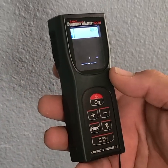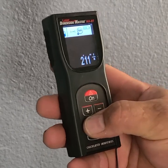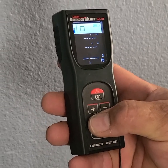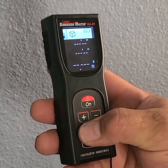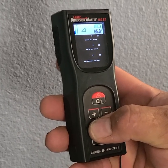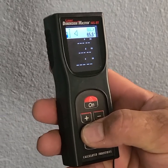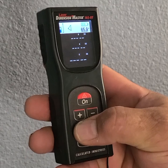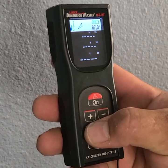On your display, an arrow indicates you're in the linear measurement mode. A square shows you're in the area measurement mode. A cube shows the volume mode. A right triangle indicates the basic indirect height mode. The isosceles triangle is the symbol for the advanced indirect height full mode. The skewed triangle identifies the advanced indirect height partial mode.